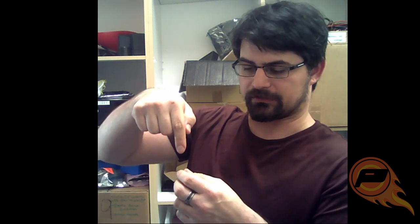And when you're about to do your bed leveling, it goes down and touches the bed. But the actuation of doing that was causing some magnetic interference on the solenoid, which was causing the signals to get a little bit weak, apparently. So it doesn't have the same level of accuracy as they're advertising, sadly.